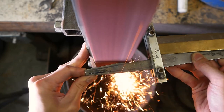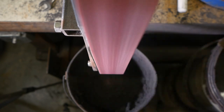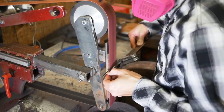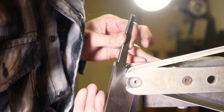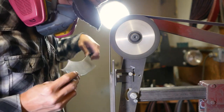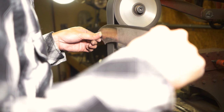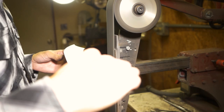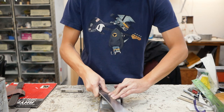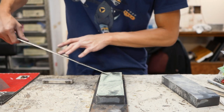Now we're ready to do the final touches on the blade. I'm grinding the tang and the shoulder where it'll meet up to the handle. I use a carbide jig and run it right up to the grinder — the ceramic belt will grind steel but the carbide is really hard and acts as a physical stop, letting me ram it in and get a nice crisp shoulder. Like all my other blades I round the spine and trail — this is critical. The last step on the grinder for the blade is to go over it with a scotch brite belt and get an even finish. Then I sharpened it up — since this is a pretty beefy slicer it gets a fairly coarse edge that'll last longer and provide a good bite to cut through meat.